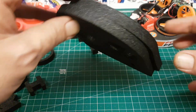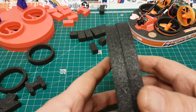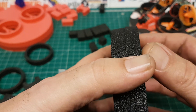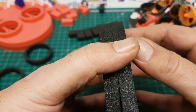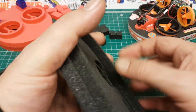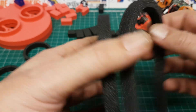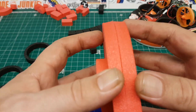So because of the nature of laser cutting, we never get a straight edge — it's really hard to do that. You see there's a bit of a taper there, very fractional. And if you want to match them up, that's going to be the best faces to line up. Doesn't matter which way up either of these go, other than that little point. You could have the tapers in — it's a little bit visible there, just a bit of taper. So you can either have them in or the other way, both out. On this one I've got them both out.